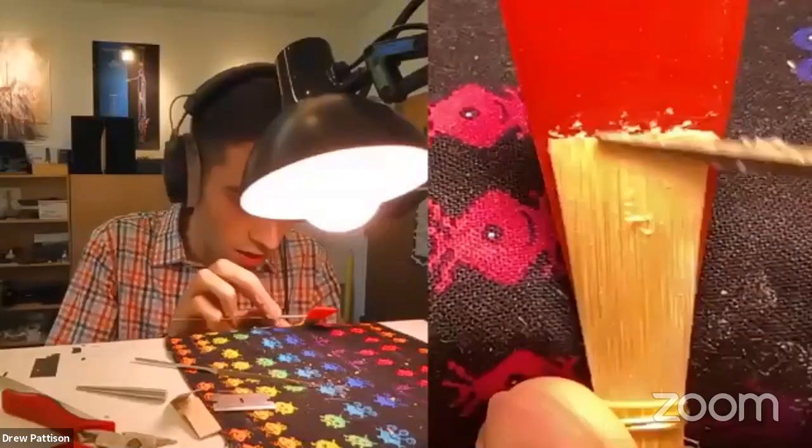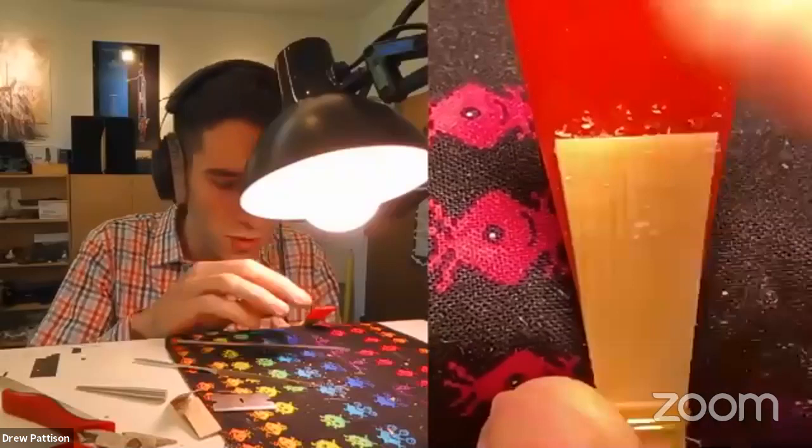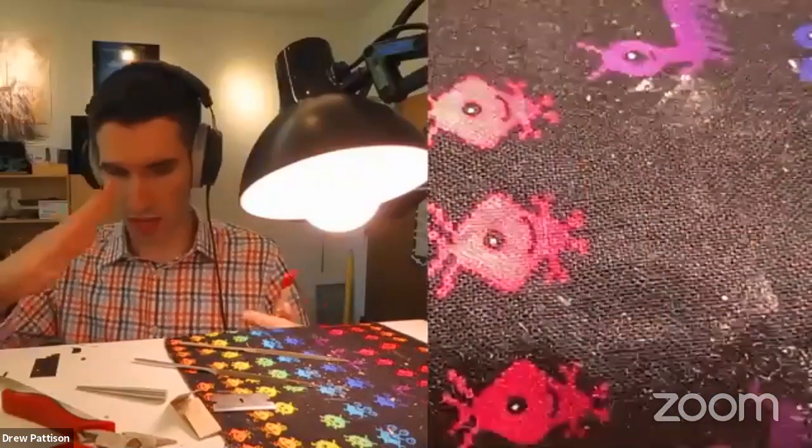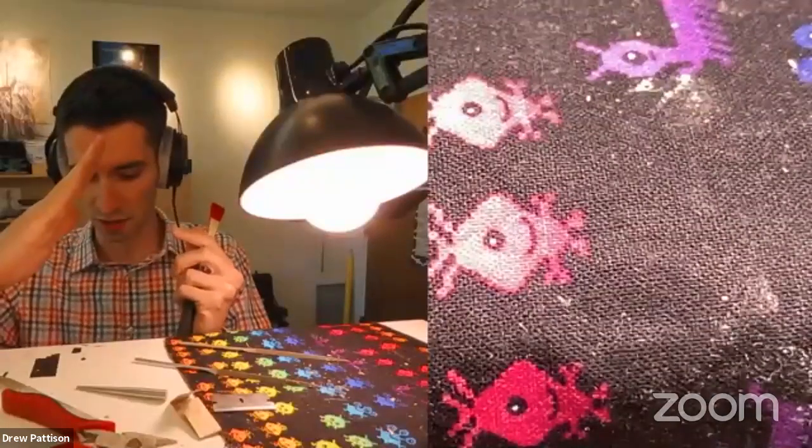Yeah, it is. I try to get a little bit of, people have different terms for it, like a little fish hook on the end of it. So you get more of the plowing motion of the knife rather than a cutting motion like you would with a normal knife. So you kind of have to do a certain angle on one side and then a higher, steeper angle on the other side, so you can get the cutting angle you want. Got it. Okay, that's interesting. Maybe you could drill a new hole in the wood so that one of your sticks is at this angle and the other one's at this angle to give you that. Yeah, I think that would work pretty well.